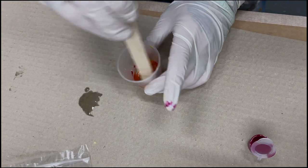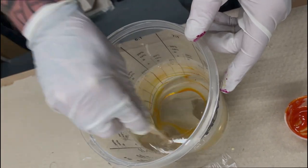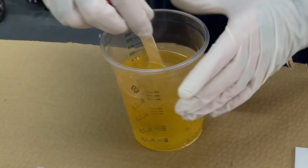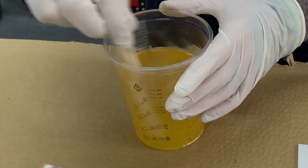While the mould was curing, we mixed amber and a tiny amount of magenta transparent pigment to create the tone of colour we needed for our resin. Just a tiny amount was added to the epoxy base resin, ensuring we made enough of the coloured batch to fill the mould.